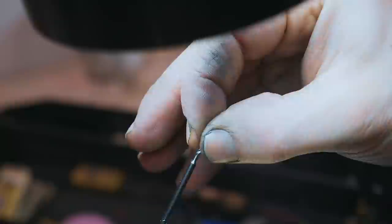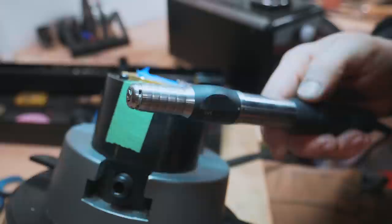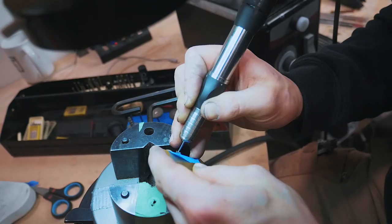With that there, I'm going to grab some drills. I'm going to use these dividers to lay out where my holes are going to go. Now I'm going to take a center punch in the airgraver and give it a little mark. Now it's time to drill it. Here's the little micromotor — I have a four to one speed reducer that gives it more torque. I'll put the bit in the collet, give it a tighten, a little bit of lube, and we're going to drill this hole nice and slowly. That hole looks a little skew-whiff — I think I might be able to fix it. And we're through. Just going to deburr it.